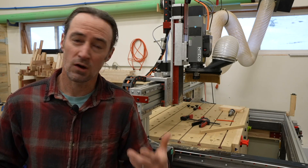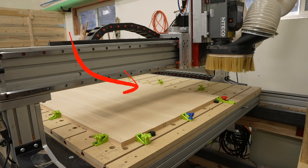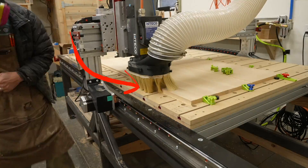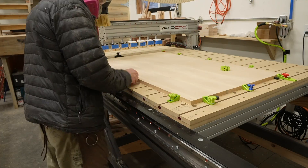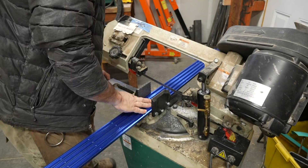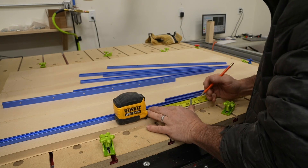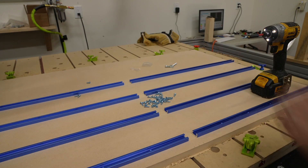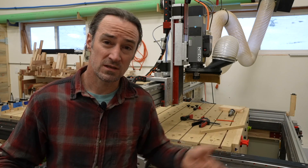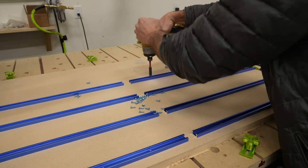Next I did a profile cut around the entire piece of MDF. The best way was one side at a time — remove clamps from one side, cut that side perfectly flat, put the clamps back, then do the other sides. This took a little time but ensured everything was aligned and not moving. My vertical table is less than four feet wide and I bought four-foot-long tracks. I cut them in half, but they were a little too long, so I cut them so there was about a one-inch gap where they'd meet in the middle, which allowed me to drop in bolts and T-nuts and slide them in.